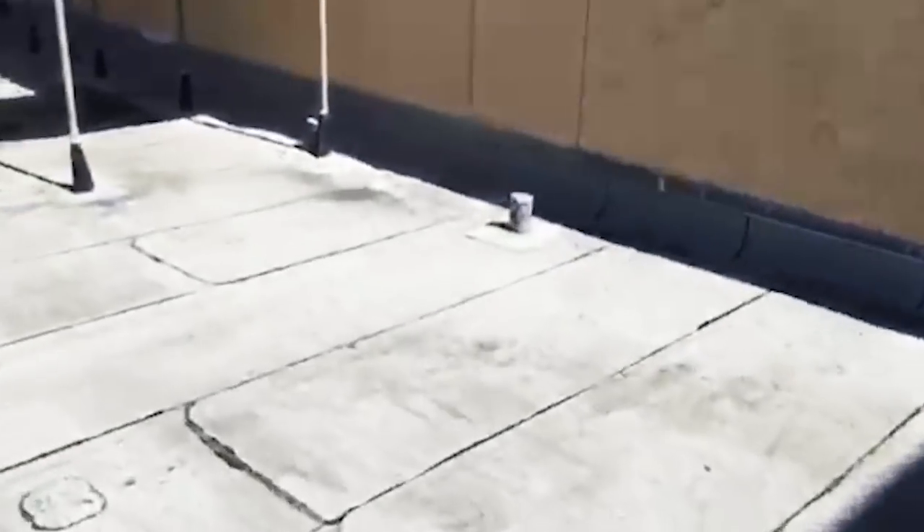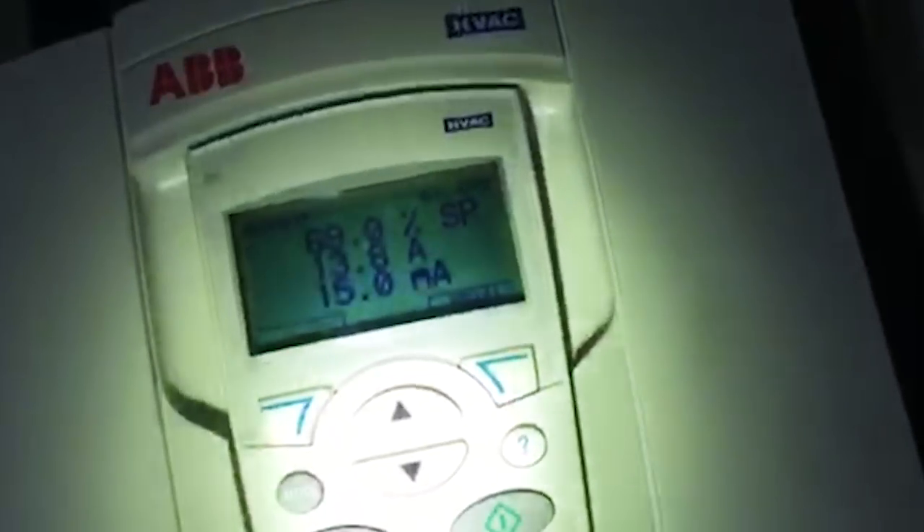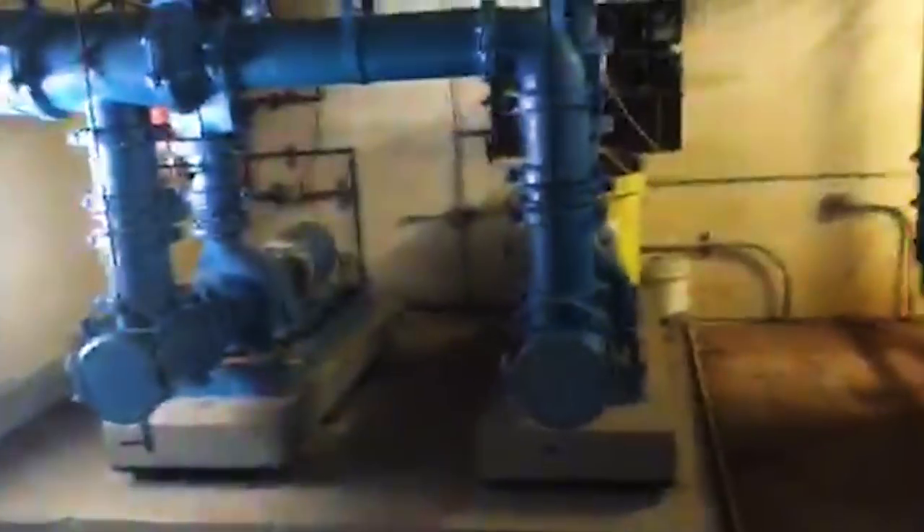That tower bypass valve is only going to do anything when we want to go into heating mode. So now we're going to walk over to the pump room. Tower fan — here's our drive, we're at 70% speed, one to ten volt DC on this particular drive. This one's in bypass; it's supposed to have been replaced, but the worst thing they could do in my opinion is put a bypass on the drive. Here you've got motor starters for the pumps — constant volume, so they always run.